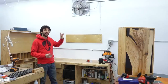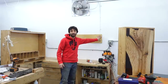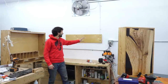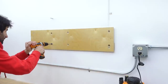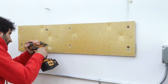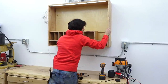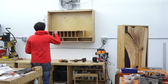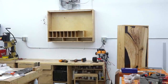Good morning. The tool cabinet did make it here just fine, no crazy issues in transport. I got started this morning getting the cleat hung up onto the wall. I decided to just reuse the screw holes on this side since now I have studs, not a block wall — I have to line up with the studs. I'm using the holes that were here already and putting some new holes down here to line up with the next stud in line. The second set of screw holes is still going to put the screw head in an area covered by the plane till, so I won't have exposed hardware inside the cabinet.